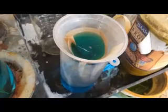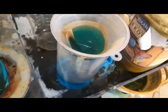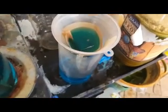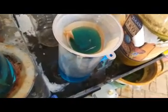I'm getting down in the solution a fair bit, so I'm not going to fill the beakers very much, because I want to be able to add more nitric as time goes on. Plus, when I'm squirting the boards off, obviously adding water to the solution, so I need room in these beakers to allow for more liquid spraying off and all that. So I'll probably fill it to about here, just over halfway. And most of the boards are small anyway. So I'll get this one set up.